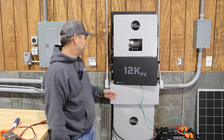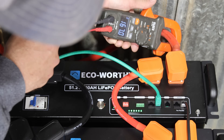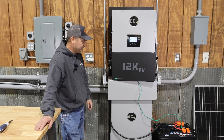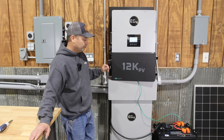All right, we got ramped up — you can hear the fans going. Hopefully you can see that — 167 amps, which is the max the inverter will actually use. I think we've fully tested the battery communication, output, and capacity. I think we ran it through the paces, and right now first impressions is it does seem to be a good battery. I'm going to go ahead and turn the solar back on and top these batteries back off before I disconnect them.